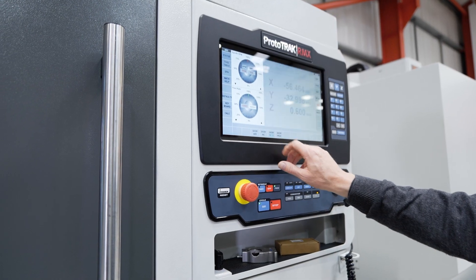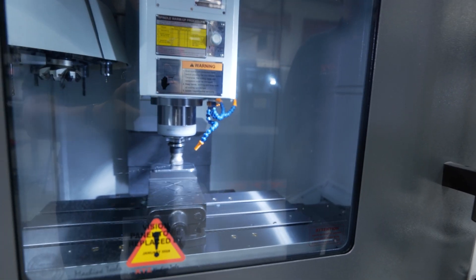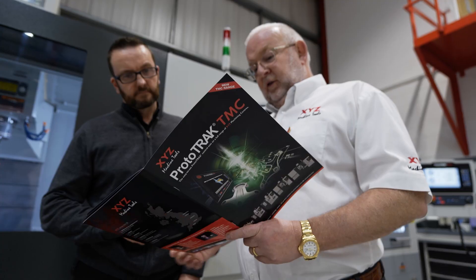Tracking is the way of putting a program into the control and running through it manually. The faster you wind the faster it cuts, the slower you wind the slower it cuts. You can also reverse through the job, so you have complete control of what you're making.